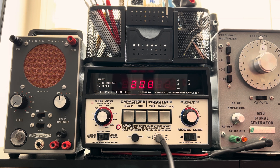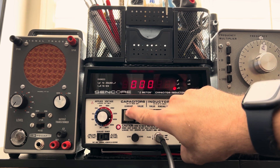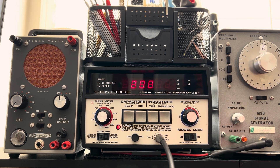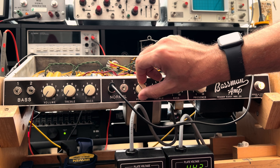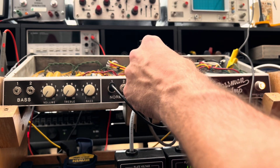I'm going to test the ones in the tone circuit as well. Checking value - not bad. Going right to 400 volts - the other cap isn't leaky either. So these caps are fine for now, but they are going to short out eventually, so I've got to change them. It was sweeping from about 10 Hz all the way up through about 800 Hz. Super healthy now, buddy.